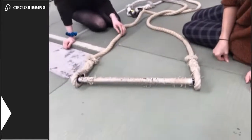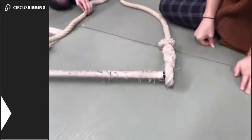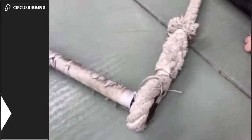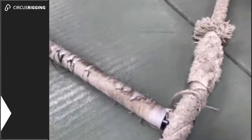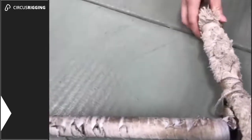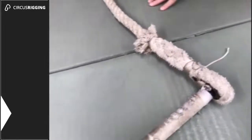And if you said that's really dangerous, I'd say, well, I'll look at the load-bearing bits and you look at the comfort bits, the effectiveness of it. The splice isn't coming apart. It's been nicely made and it's been seized at either end, which makes a lot of sense. In terms of strength, it's massively, massively stronger than you will ever need it to be. Really, it's a question of, if it's a natural fibre, make sure it's kept in the dry.